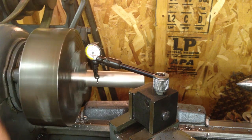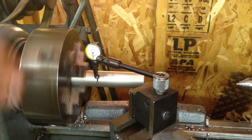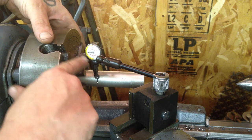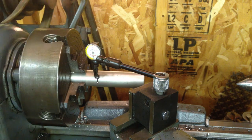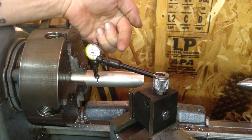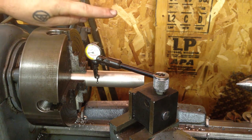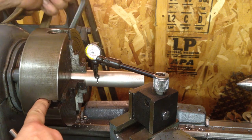When I spin it you can see it looks okay — not really wobbly, but a little bit. So I'll advance the carriage as I spin it until I get some movement. There's a little bit; I'm going to do a little more. Now it's really obvious — you can see it go way up there. That's about seven notches. So I'm going to work with this jaw, then turn it 180 degrees — and it's at zero. That tells me the piece of stock is closer to the camera than it is on the other side, meaning instead of spinning like a rotisserie it's wobbling toward and away from the camera. I need to tighten this side as I loosen the other side.